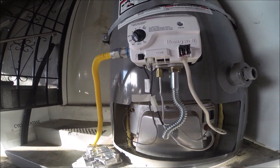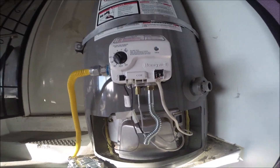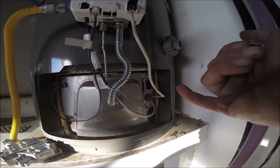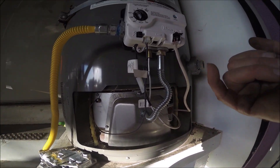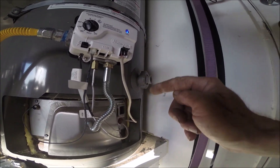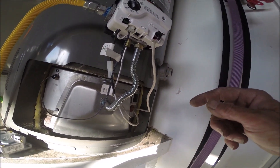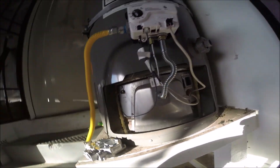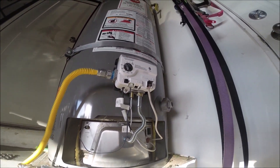That's your typical code seven — thanks a lot Honeywell for these overly sensitive, dysfunctional valves. You can convert these over by putting in a mechanical valve and changing the pilot assembly to one with a thermocouple, because older mechanical valves require a thermocouple at less than 30 millivolts, while these require a thermopile at about 750–800 millivolts to run the circuit board. Anyway, thank you for watching, consider subscribing, and hope this video helps somebody.